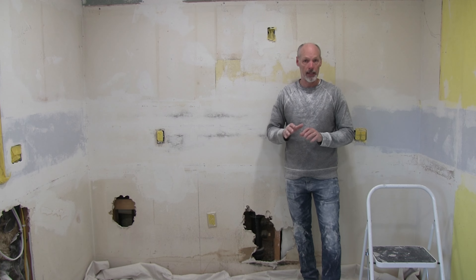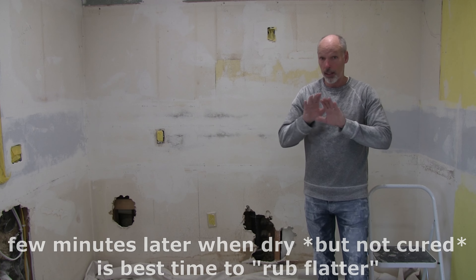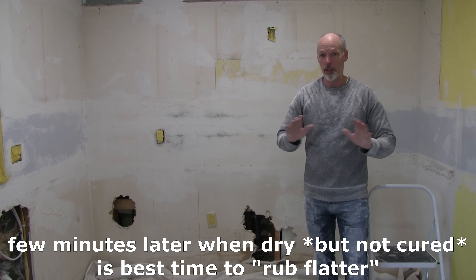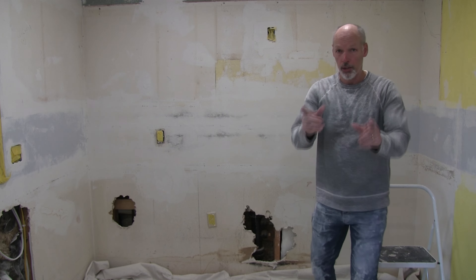Walls and ceiling have been painted so many times. Her wall is kind of a hybrid between flat and orange peel. I'm debating whether or not I even want to use this, because when I spray it on it looks like it has maybe a little too much texture even at the finest spray. I think what I'm going to do is spray it on and then before it dries, kind of slightly wipe it just to make it so it's not quite as pronounced. There's an art to this, I'm sure.